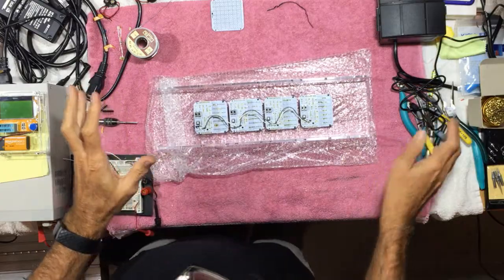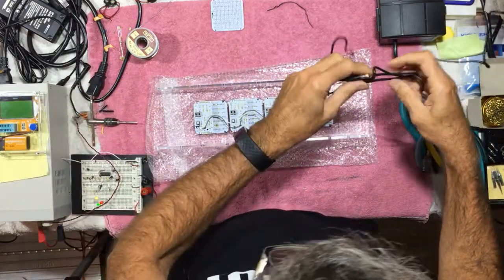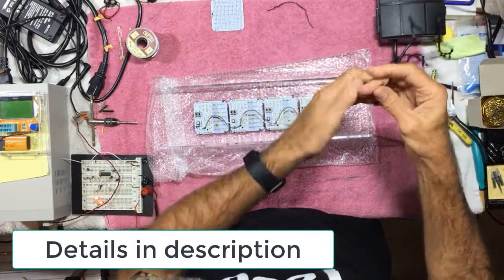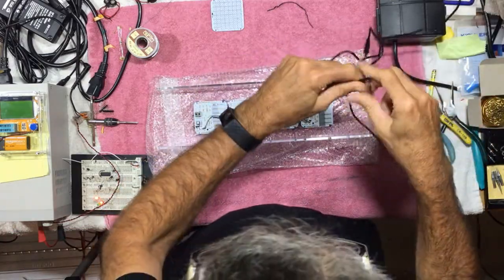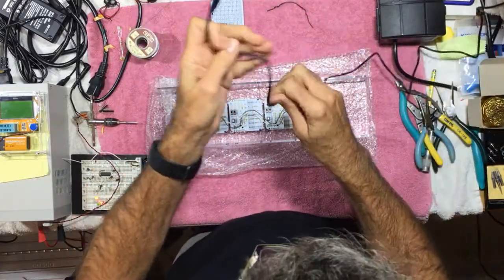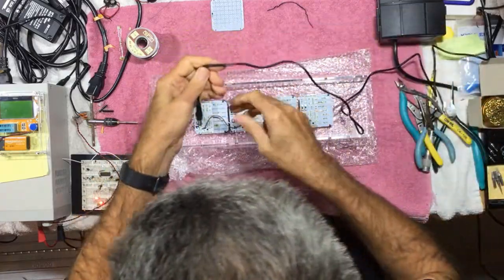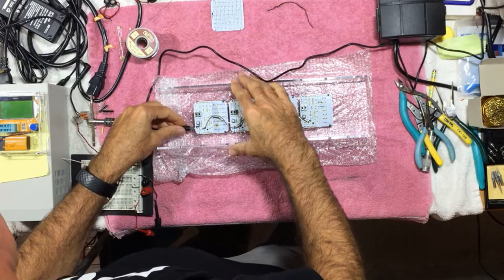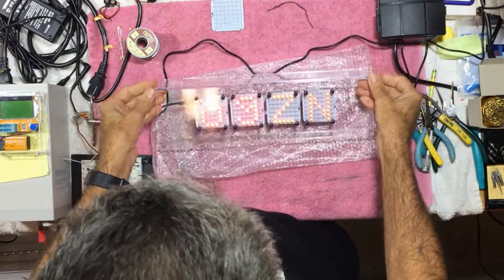And perfect timing, because today from Amazon came the 9-volt adapter. This is a 2-amp 9-volt adapter. The maximum current draw for each of these boards is about 80 milliamps, so plenty of capacity with a 2-amp adapter. And again, I'll put all the parts description in the description of this video. So let's plug this in and make sure it's working. All right, there we go.